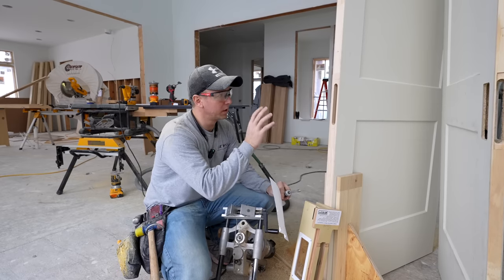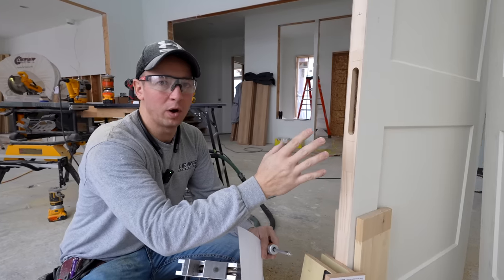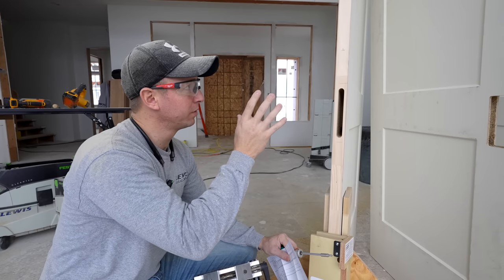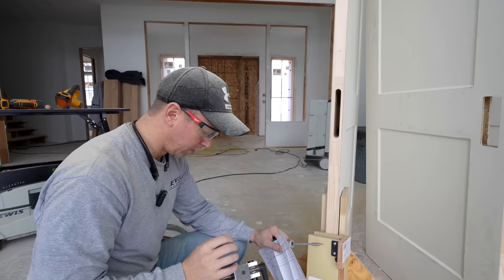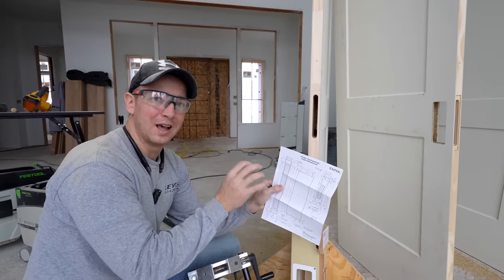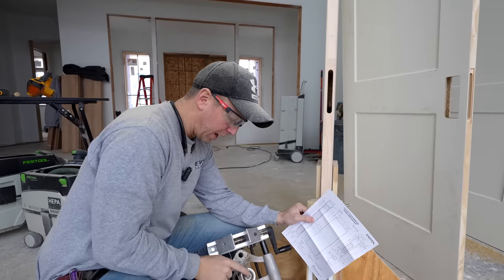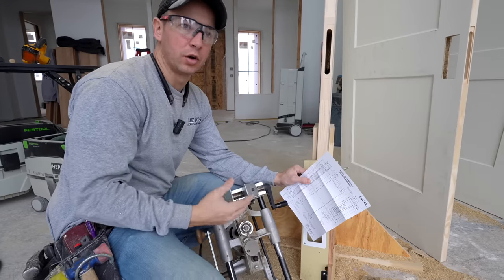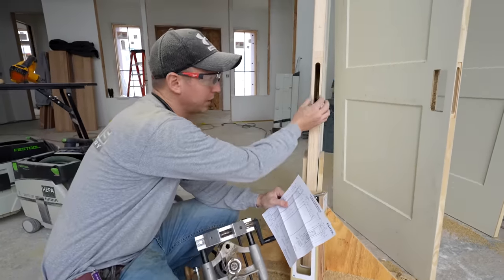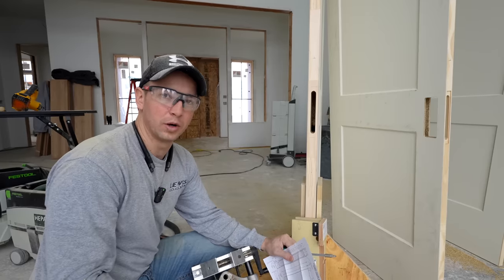One quick note, this is a problem that I encounter fairly often, and it's that the mortise is not quite centered exactly after I do this whole operation. That's why I was really trying to get it perfect. For some reason, it still didn't center quite right. But on the Emtek literature, they recommend a 11/16 wide mortise right here. Now, the cutter that I have on mine is actually 3/4, so it's oversized by a 16th of an inch. I find that's really helpful because it gives you a little bit of extra space in case that mortise is off, so it doesn't cause the hardware to malfunction.